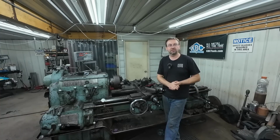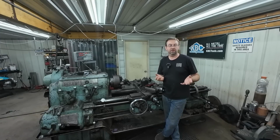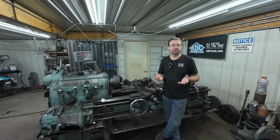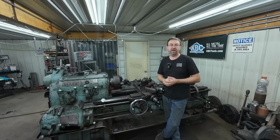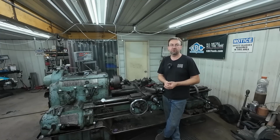We had a lot of great comments on this video, a lot of good questions. A couple of them that I saw were, why didn't you just weld them up and remachine them? It was completely faster to make new ones. You think about the time involved to weld all that up, and all the wear was on one side. Now you have to chuck it up, figure out how to hold it. There was no center in those, just on the one end where the grease zerk was, and you don't know that that's perfect either. Then turn that weld off, which is usually harder.